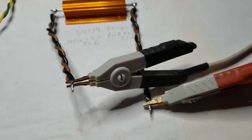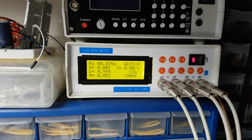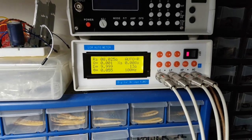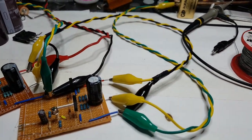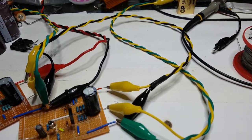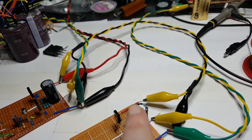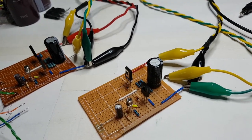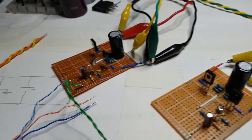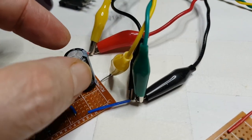I've soldered those wires on and the resistance now is still very low - we're still on eight ohms for all intents and purposes. So let's get this connected up and I'm going to solder it onto these wires as well, just to make sure we get a good connection on the ground and a good connection on the output of this capacitor. I've used 4.7 microfarads here and I've got one 2.2 film which would be better, but then I'd have unmatching capacitors. At this point they're matching, and the only thing different is that one capacitor is at a slightly different angle - twisted one hole to the right.